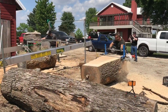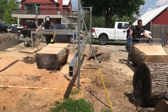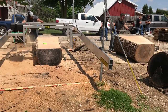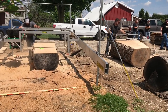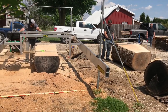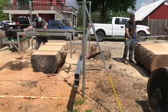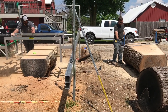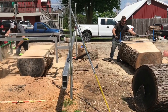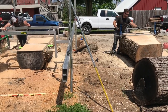We're going to get a different angle here on the Lucas mill. There's plenty of good videos on chainsaw milling so I'm not going to go too deep into the Alaskan mill side. The Lucas mill, as you can see, is four posts and two long rails — the rails are about 20 feet long. I think he has a max cutting length of about 17 feet. You can see we're both pushing on the carriages. Mine is referencing the log, and his is riding along the two long rails. So it's similar in theory but different in horsepower, speed, etc. Where mine references the log, his carriage is what's adjustable — those long rails go up and down and can go at different angles, and that's what sets his cutting height and depth. It's an Australian product; a lot of commercial guys have them. Definitely more of a commercial application, and it was out of my price range at the time, but if you're into productivity it is definitely the way to go.